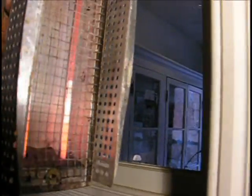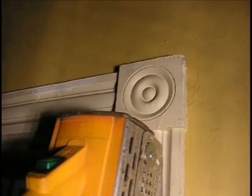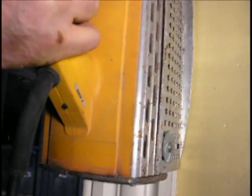The same technology as a quartz space heater. They have 2 quartz heating elements in there. They're designed to heat the paint but not release toxic fumes. It still will burn the paint. That's why you have to make sure on the side guards that the heating element is about 2 inches from the paint.